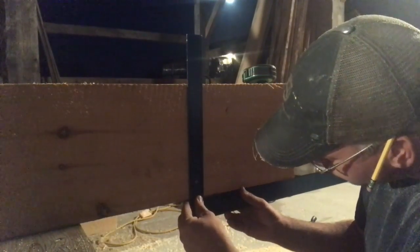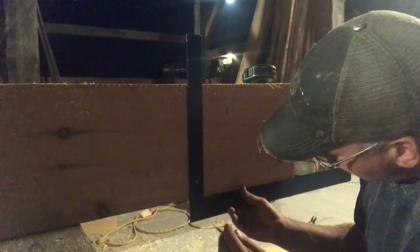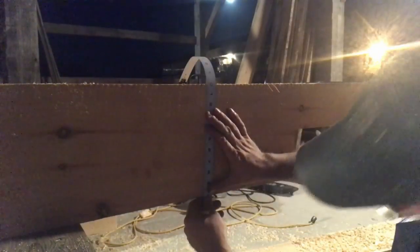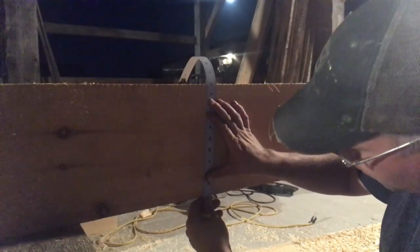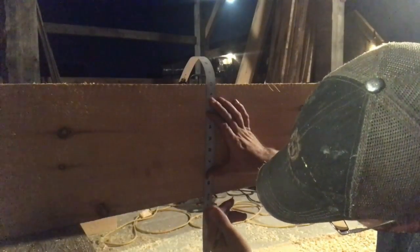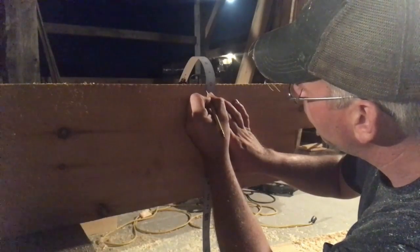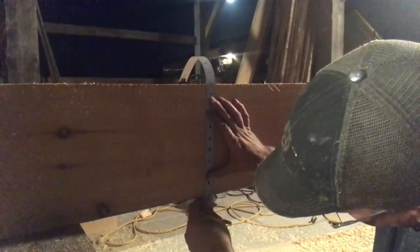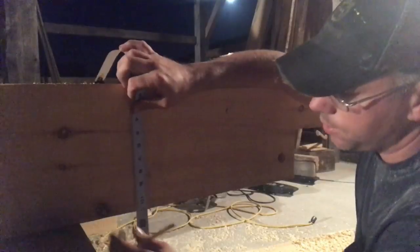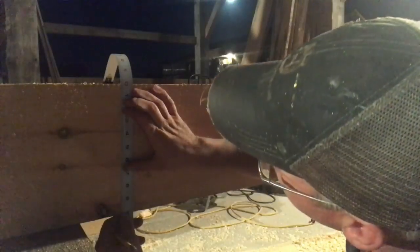and as you can see, mine are. I mean, not too bad, at least it's square. But so anyway, from my bottom here, we're going to measure with this, be a little more accurate. So I'm going to hold 10 inches there, and I'm going to measure up, end up being 9.5 from the arris here. Double check myself. Good there. I'm going to come across and do the same thing from this side. Remember, this is from the arris, guys. Sorry if my head's blocking the shot here.